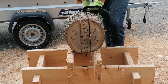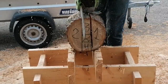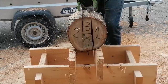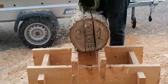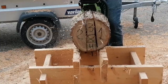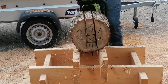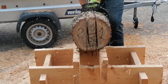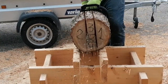The chain I use is for normal cutting and has an angle of 30 degrees — it's not the optimal chain for cutting wood in this direction. If you need to cut a lot of wood, I would suggest buying a rip chain. It has fewer teeth and cuts at 10–15 degrees, designed to cut wood in this manner. But for a hobby turner like me, doing this maybe four or five times a year, I can do fine with the normal chain.